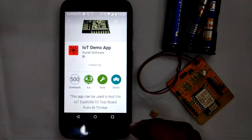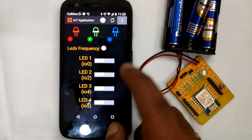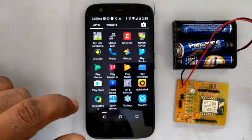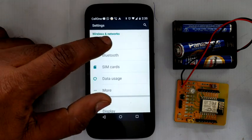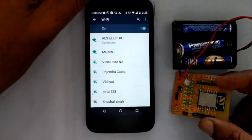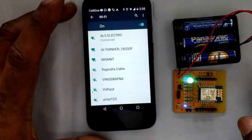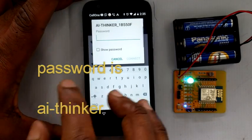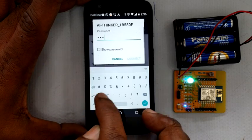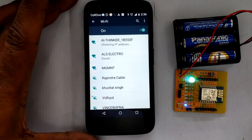The app is used to switch the six LEDs on or off and to control or mix the color balance of the RGB LED. Once the app is installed, it should be connected to the ESP board over Wi-Fi. For this, open the settings of the Android phone and then touch on Wi-Fi. Now remove the yellow jumper on the ESP board and then power it on by placing the batteries. Your phone Wi-Fi will detect the AI Thinker SSID. Now pair it using the password 'ai-thinker' all small letters. Your phone is now paired with ESP8266 and you are done with the settings.